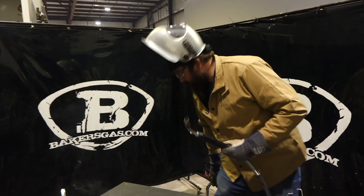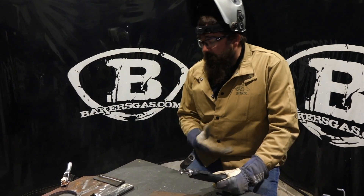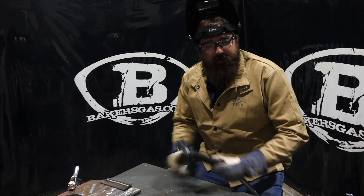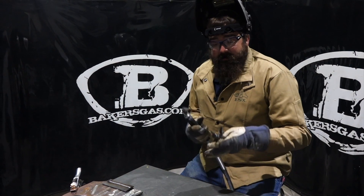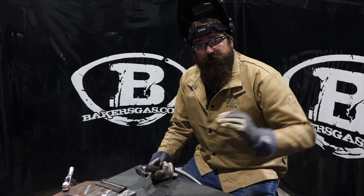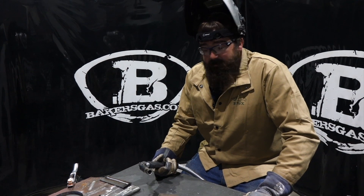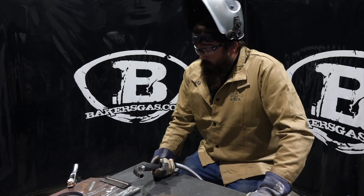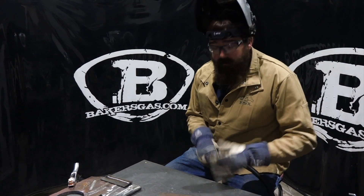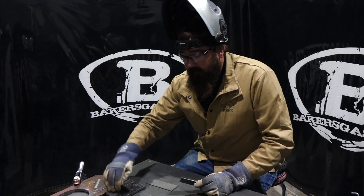That looks pretty good. So the Pulse feature on this unit is for thinner sections of material, cuts down on spatter. I'm not saying it's necessarily for thinner sections though — you can weld thick sections with it. It just helps with distortion. So you're bouncing between a spray transfer and a short-circuit transfer, and it's cutting down on distortion on the piece. Welded pretty nice on that Pulse setting. Now remember, we're running the 90-10 gas because we are in spray transfer part of the time.